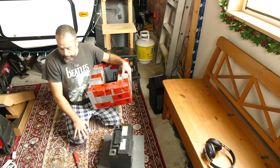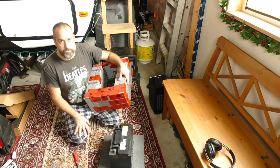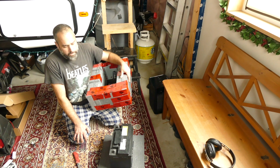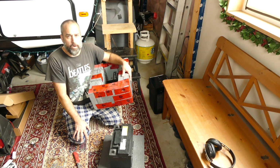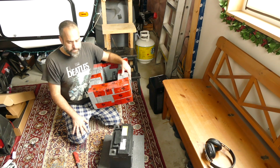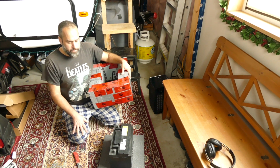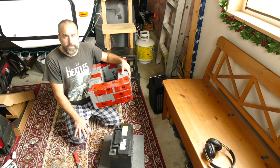However, my plans for this battery at the moment are two things. Right now, running these solar lights, which are 6 watts per hour, and then running a fan for the outhouse, which I think is 2 watts per hour. So my hope is with this 200 watt system, which is a little bit overkill for this battery, that we'll just keep it tippity topped up, and the small amount of draw that we're pulling off the top is probably not much different than the constant draw that any vehicle has.